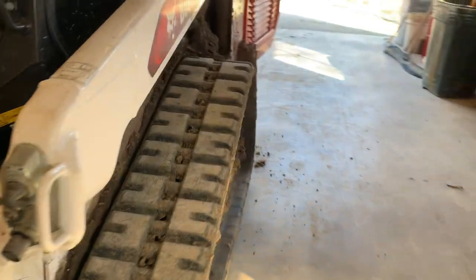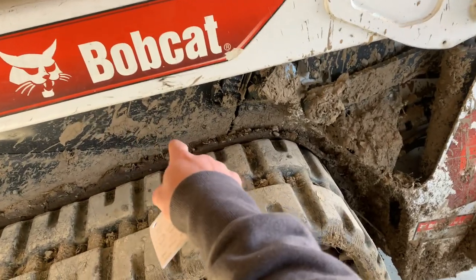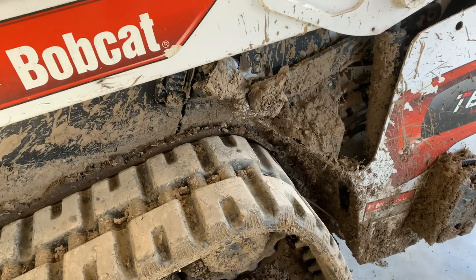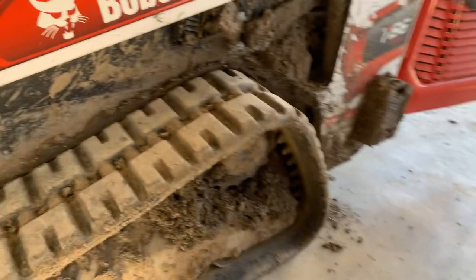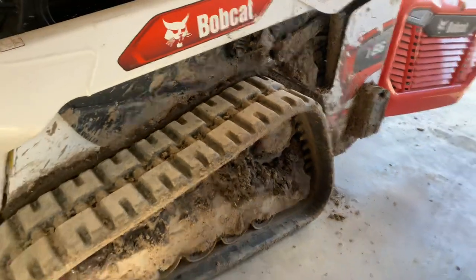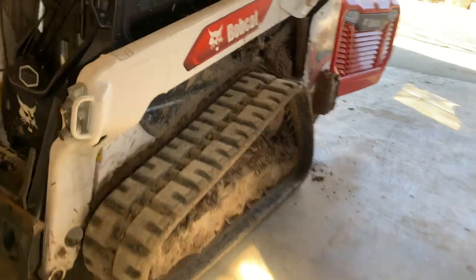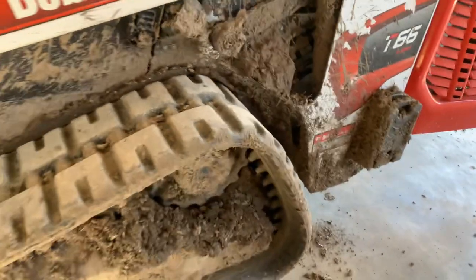Here's another one I hit in my last video — checking the hydraulic fluid level. Let me show you: it's somewhere back in here under all this mud and you just can't find it or read it. If I'm on a job, something goes wrong, I need to check fluid level, I'd have to spend an hour cleaning just to find the sight glass. That's just terrible placement — move it. Also those covers over the hoses: I like that you can remove them to get to the hoses, but they're in a bad spot and are going to get smashed.